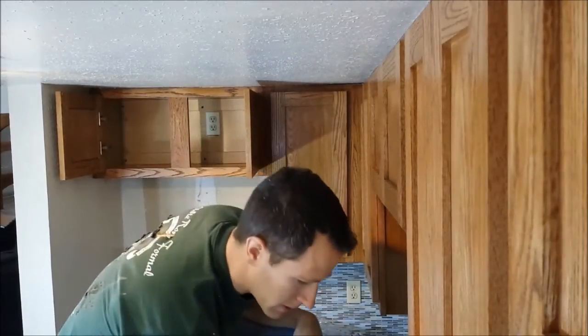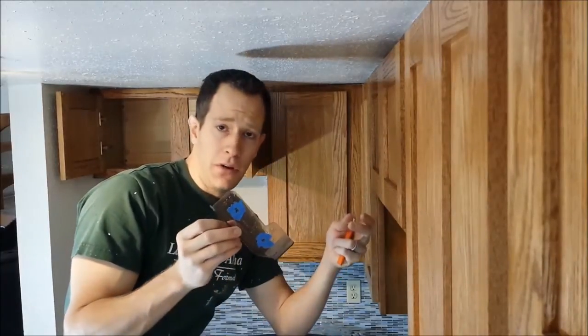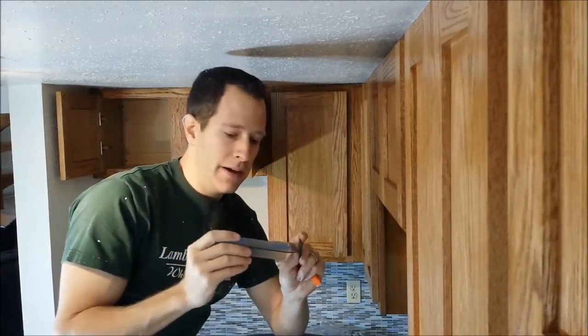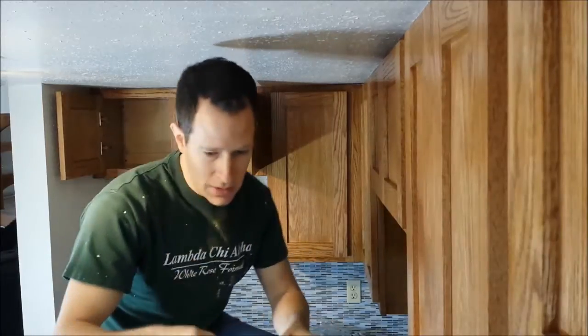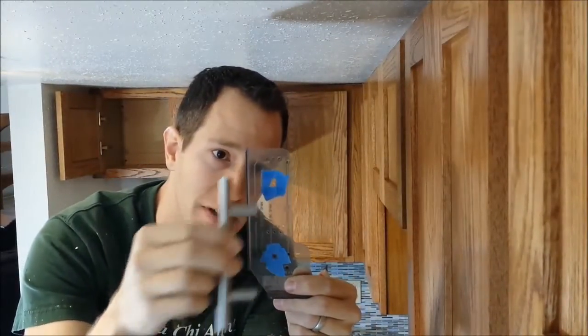I've got my hardware here. I bought a little jig — you can make one of these at home, but they sell a kit at Home Depot for about $10. It's got all these preset holes. You can see that I've got the ones I'm going to be using marked off in blue tape. Since I'm going to be doing this a lot with all the same size, I marked them off so I don't make any accidental mistakes and don't have to check it every time. These holes are spaced 3 inches apart, which is correct for this handle — you can just line it up to see.